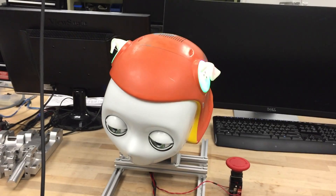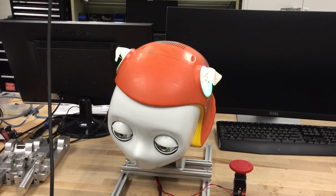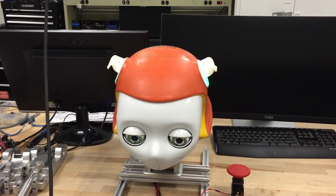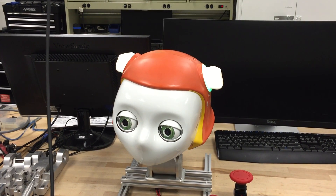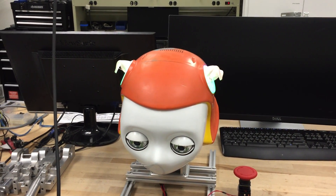Now there's still some bugs. We have a few loose wires on some of the old encoders, and we're not exactly sure where, but on a couple of different joints, the position signals drop out for moments at a time. And of course, when that happens, the joint goes crazy.